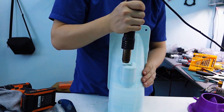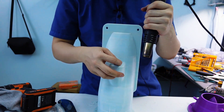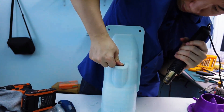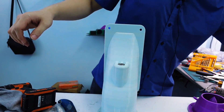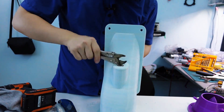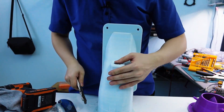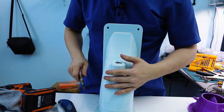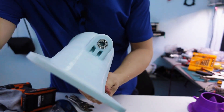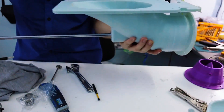Next I'm going to install the bearing onto the shaft of the turbojet engine body. Since the design has a very tight tolerance — almost a perfect press fit — I won't be able to just slide it on by hand. So I'll use a heat gun to warm up the bearing slightly, causing it to expand just enough to press onto the shaft smoothly. Once it cools down the metal will contract and grip the shaft tightly, creating a super secure and snug fit.